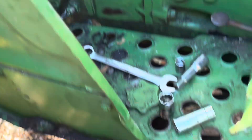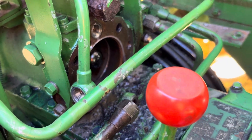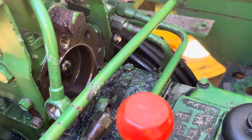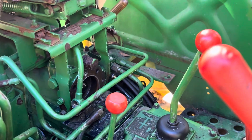I just got this tractor and I knew it had some issues — milky hydraulic fluid, everything that was behind stuck in the three-point, nice and clean though. I already have the fluid to give it a change, probably run it some hours and give it another change.